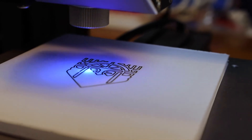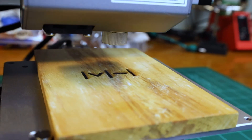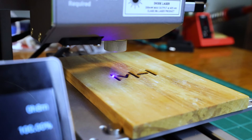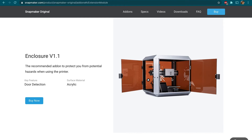There is a huge price difference between the Snapmaker and Glowforge, so it's not a very fair comparison. And considering the Snapmaker laser is in open air, I wouldn't want anything much more powerful than 1600 milliwatts anyway. Since it's made from easy-to-obtain materials like aluminum extrusion, replacement parts and upgrades are actually pretty cheap. There's a height extension upgrade available for $99 and Snapmaker also sells an enclosure for just $129.